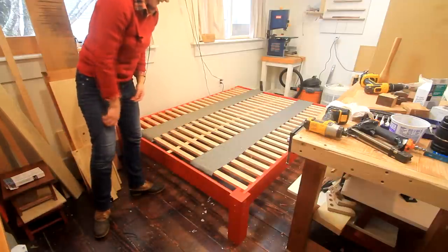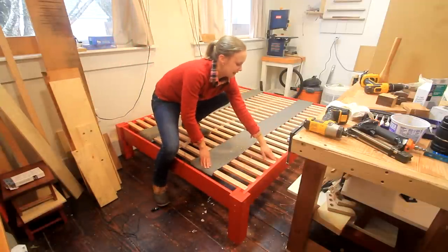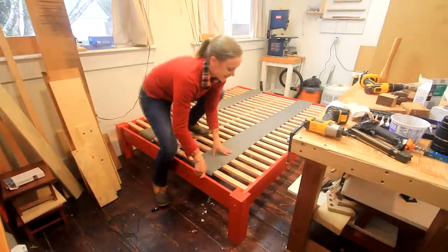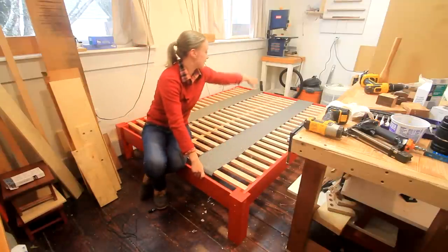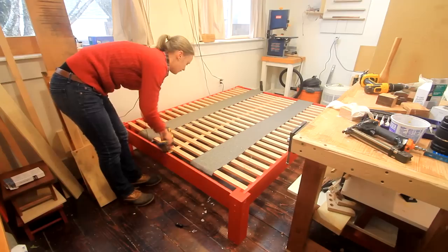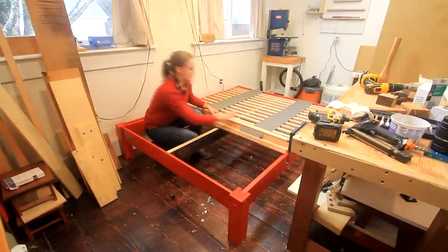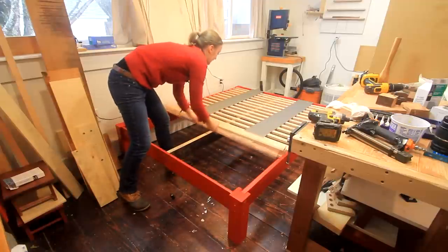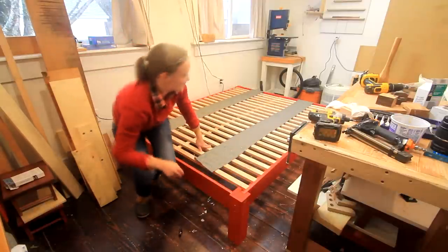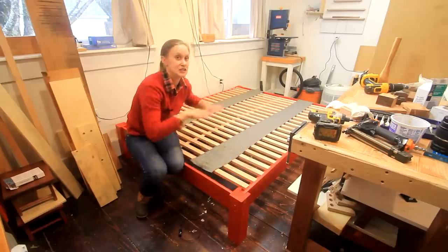Since I wanted this to be easy to move, I pre-drilled the slats and then cut them up. To know where the holes were and make reassembly easier, I stapled a thick fabric over them. I screwed them all down and then stapled the fabric so you can just take out the screws, roll everything back up, and because it's all spaced by the stapled fabric, it's easy to find where each slat goes — as long as you screw the first one in right, they're distributed evenly.